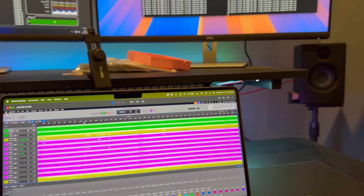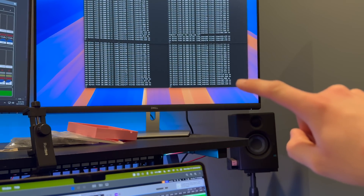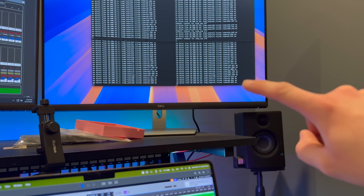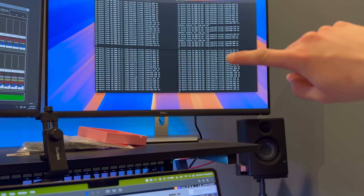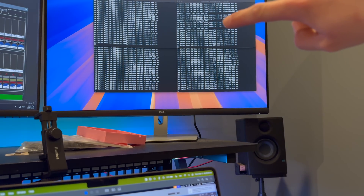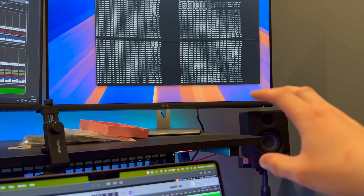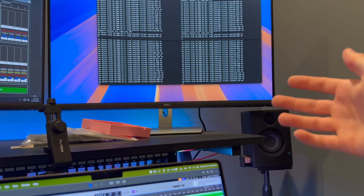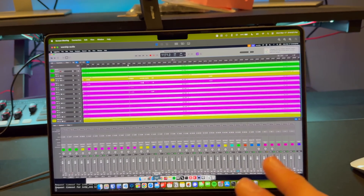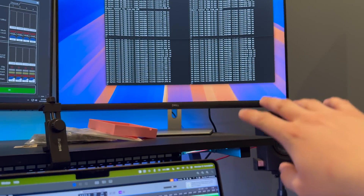When I play the audio tracks you'll see the pings quickly spike up — from about 20 milliseconds up to about 200, 500, back down, 1983, 59 — and that goes across all VLANs. We actually have dropouts to the core as well. Keep in mind the IP addresses I'm pinging are not on the Dante network; they're on a completely separate LAN. These should have nothing to do with Dante or Q-SYS, since there's no Q-SYS or Dante traffic going through any of these IPs.